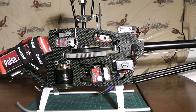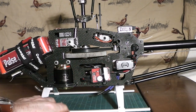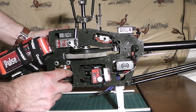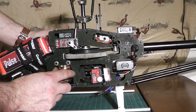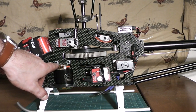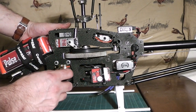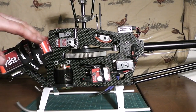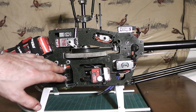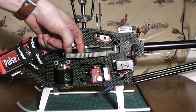There are a few key things here that are going to help you out a lot. First off, you want to go ahead and get your motor in. Don't loctite your screws just yet — you don't even want to really tighten them down. Just get them in there so that you have some play with the motor, so that you can get the motor to move back and forth. You also want to make sure you have correct slots. I had to cut a little bit of extra slot in my 6HV — the screw holes are almost perfectly round. You want a nice slot in there, so if you notice you're not getting any movement forward and back with your motor, definitely get a little file and just make the slots slightly larger so that you have some leeway to move forward and back. That's going to be imperative when getting the teeth of your gear on the motor pinion to mesh with the teeth on your main gear.